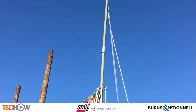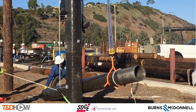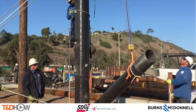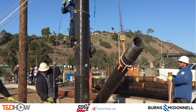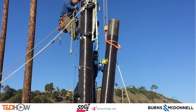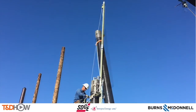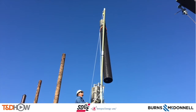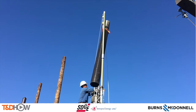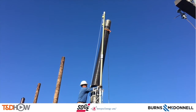Looking up to the top of the pole gin, we go back to the ground and watch as they start to lift the next section of this composite pole into place using the rigging. We can then look back up on the pole as the third section is brought up and set onto section one — the pole butt — and section two. The total height of this pole will be 45 feet when complete.